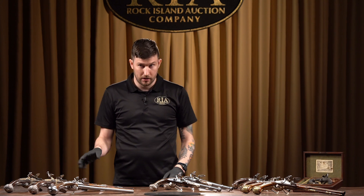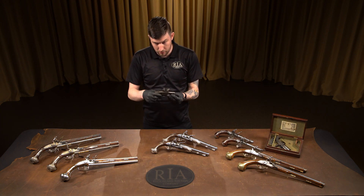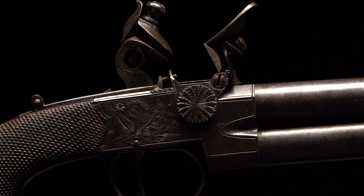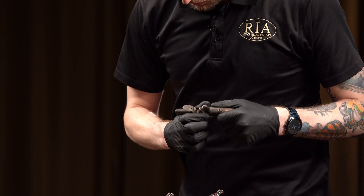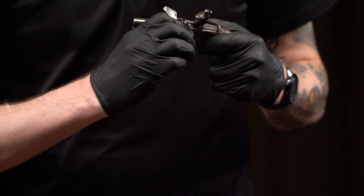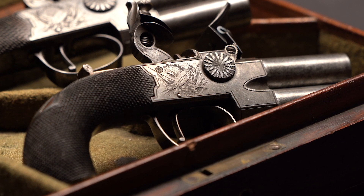One of those ways is on this little tiny pair here — these are from the early 19th century, kind of like concealed carry circa 1800. On this pair, you've got a single box lock action, single frizzen, but if you look carefully at the pan, this pan rotates via this little lever on the side. When it's closed like this, it would just fire the upper barrel, and when you turn it like this, there's a hole in the bottom of the pan that would then fire the lower barrel. It will actually hold two powder charges — a smaller powder charge for the lower barrel. So this pistol, especially when you have a pair, would actually allow you to have four shots instead of a single shot or just two shots with a small pair of pistols.